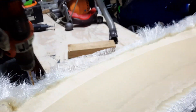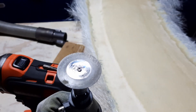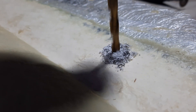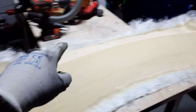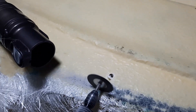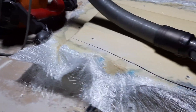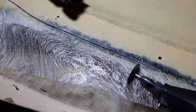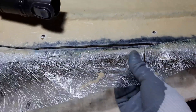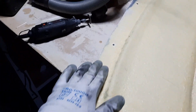The next step is to put in some bolt holes and to trim the part. These are all around the perimeter on the outside of the mold flanges, ready for clamping the mold together later once it's been laid up with glass fiber. Now using the Dremel and the trusty Dyson vacuum cleaner to extract all the dust — you really don't want to be breathing this in, so make sure you have a mask, gloves, and goggles if you're trying a project like this. Running around the outside with a diamond disc trimming everything back gives quite a smooth edge, so it's not going to cut your fingers when you handle it later.